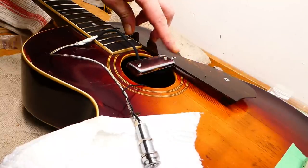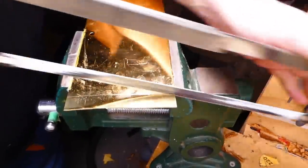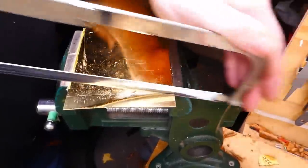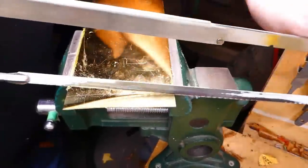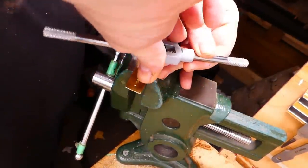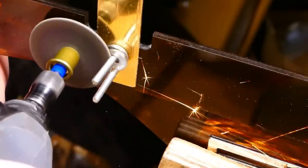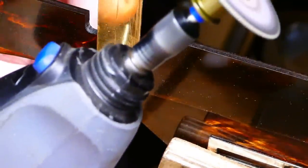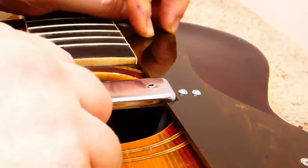It's funny how this worked the last time — they're all different; the geometry does not match in every guitar. I lost the footage of making the pickup support arm out of wood that screws to the pickguard. The previous iteration just wasn't working — it was too thick. So I decided some brass plate would be a good alternative, and that I could make threaded holes in it and thus use shorter screws. Here I'm using a tap, which is the device that makes the internal threads. Here I'm cutting the screws to length using some washers as a standoff, because I want to leave extra room in case I need to add a spacer to adjust the pickup height. Now I can take this apart and bend that piece of brass to the angle I need, so that the pickup is going to end up sitting roughly parallel with the strings.